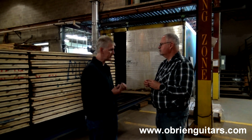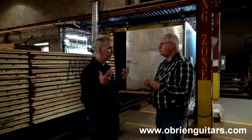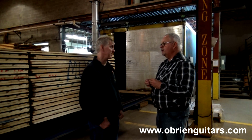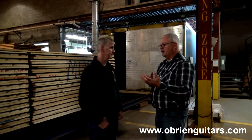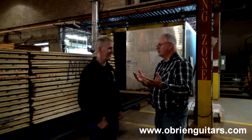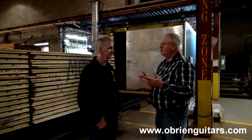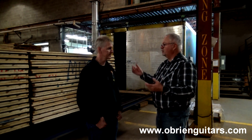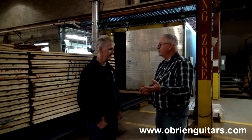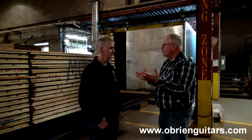What about tone? What does it do tonally to the wood? Because we're luthiers, we're building instruments. A lot of people say the torrefication process is better tonally. Can you tell us anything about that? There is a study that was done in Germany that basically says, without getting into any scientific stuff, that it replaces about 30 years of natural air drying. It's the same process as a guitar that's been kicking around for the last 30 years that everybody rants and raves about the sound of, like a Martin guitar that's been around, that it has a better tone to it.